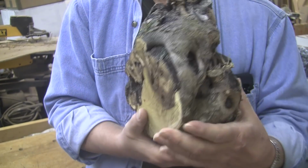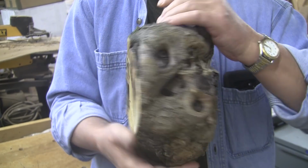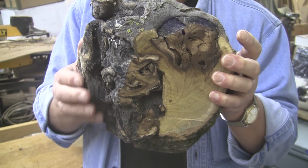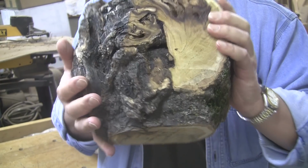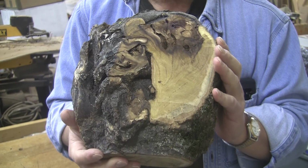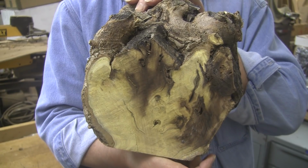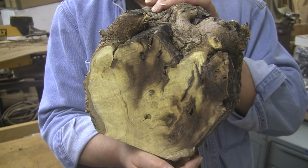I think what I'm going to do is take this, if you look at this, that looks real nice, full side. And then if you look at this side, not quite so full. We've got this piece sticking out here. So I think I'm going to take this over to the bandsaw, lay it down, and cut that side off to where it's not quite flush, but close. Then I'm going to set it on my stationary belt sander and smooth out this side and this side. I think my belt's only 120 grit, so it's not going to be a final finish, but it'll give me a good head start on sanding once it's on the lathe.